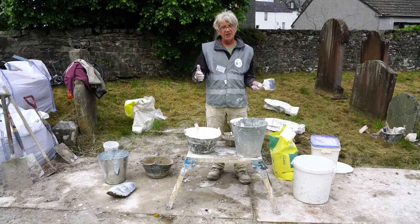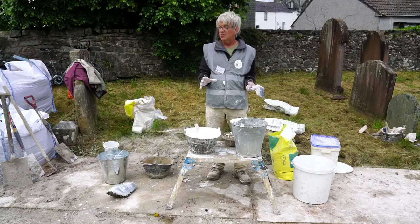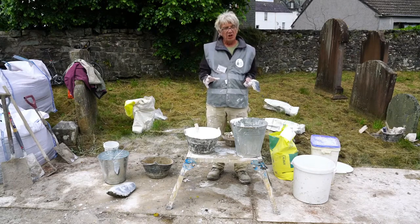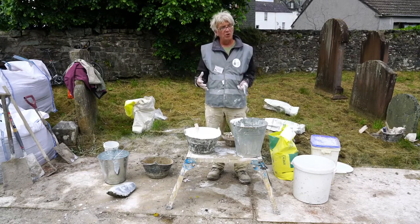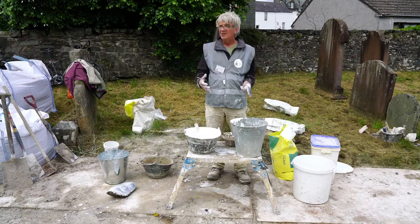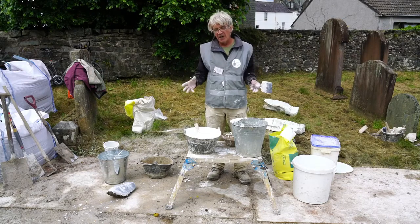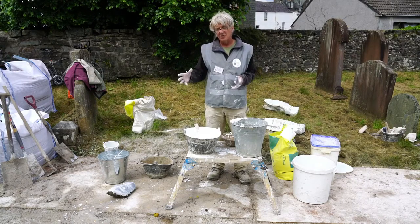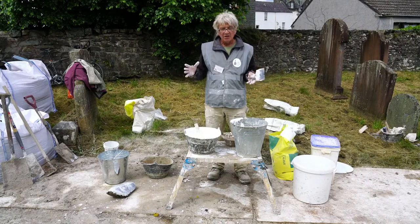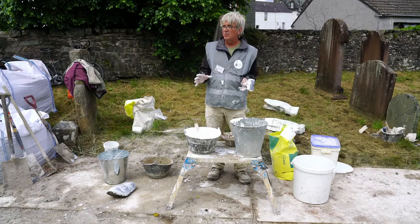If you put linseed into your last coat of lime wash, because you can actually only put it in your last coat, as soon as you've got linseed in that lime wash, you are never going to be able to retreat that lime wash with another coat of lime wash. It won't stick to it. It'll just come off it. And tallow the same. The US Park Service thought that these additions were to improve the stickiness of it somehow, but it certainly wasn't to improve the performance.